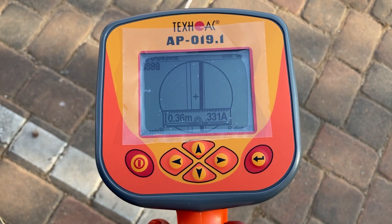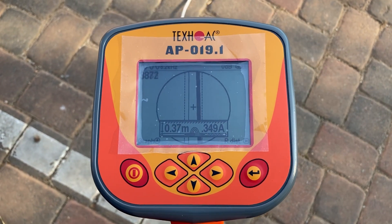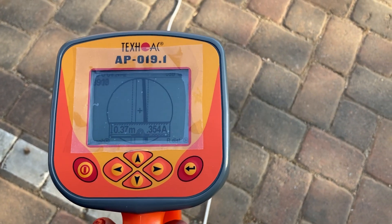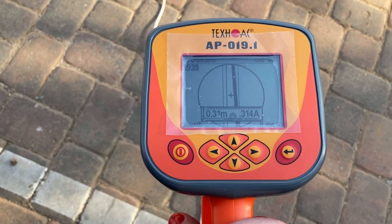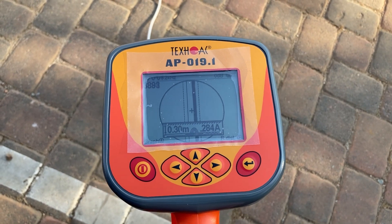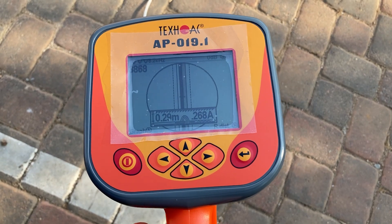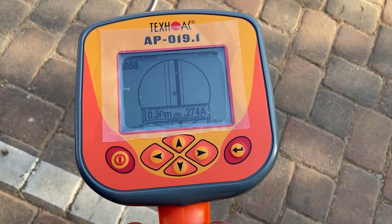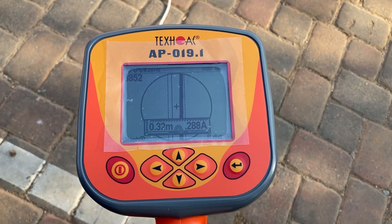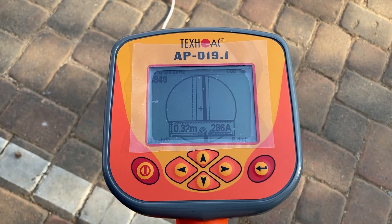This is where grounding of the cable or the pipe would be applicable on either end to contain the signal, because with the induction method the signal is stray — it can bounce off surrounding pipes and cables if it's not contained. As we have it now, it's not grounded but it's still detecting where it is. This is a safe way to locate a cable if you're not sure if the cable is really dead or de-energized, or if the voltage is too high and it's not safe to connect directly — this is one of the methods you could use.